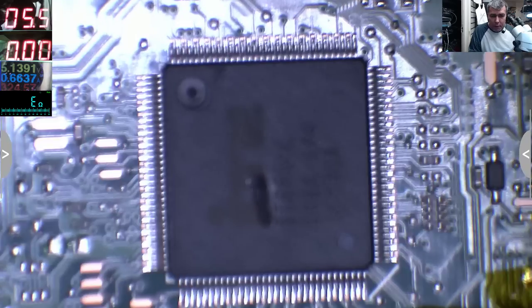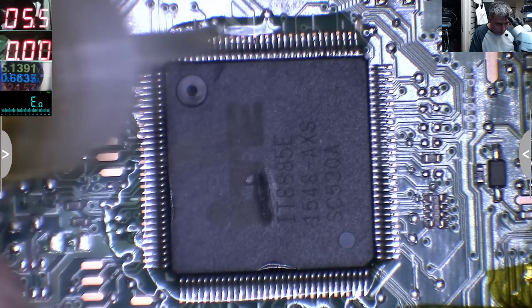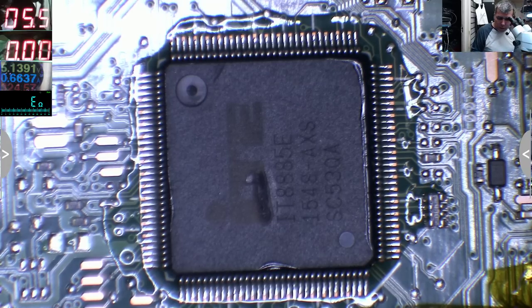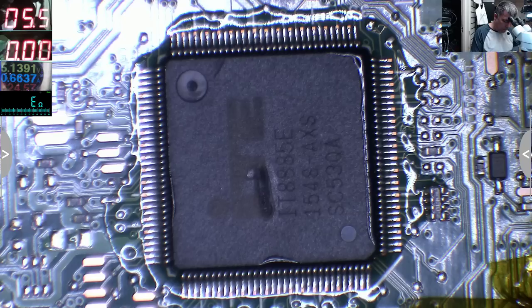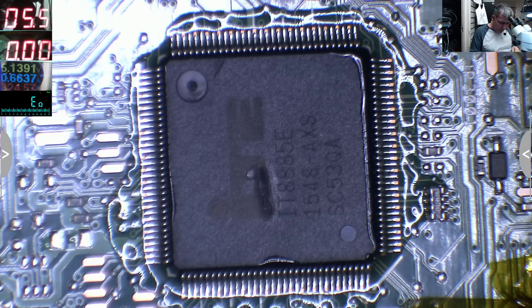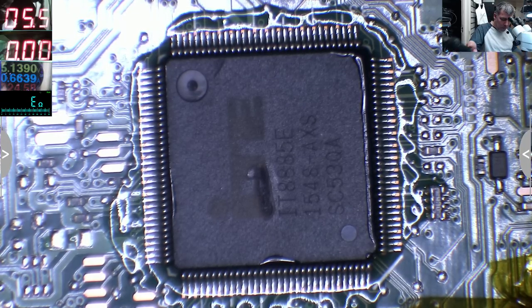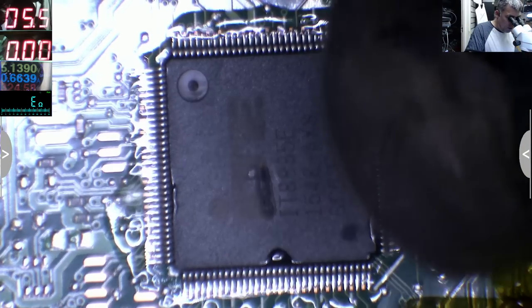Okay, the first step, let's take the chip down, yeah? I will use my liquid flux because we will come with 500 degrees to take the chip out. The chip position, yeah, it's on that side. I need a big tweezer. It looks fine. Let me remodulate this tweezer to fit our purpose. Yeah, now looks fine, yeah. 500 degrees. It's just like a quick injection, you know. We'll take the chip out, yeah?